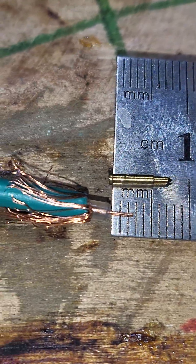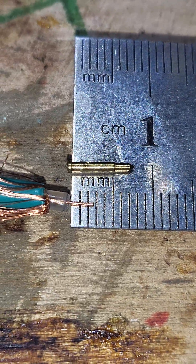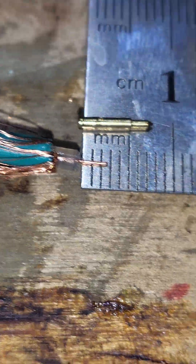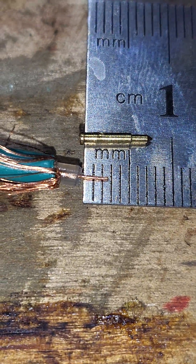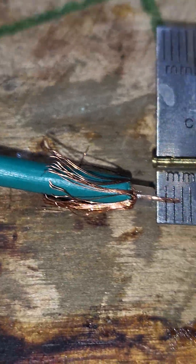This is a response for icam guy. Sorry I don't remember your name. The measurement I use is almost three — it is three millimeters for the center wire of the antenna. We are talking about SMA connectors here. I solder this to the center wire and then this part I solder to the grounding wires.